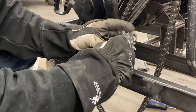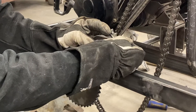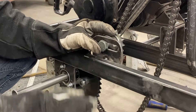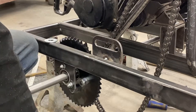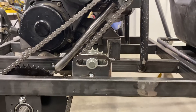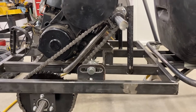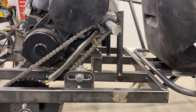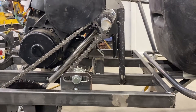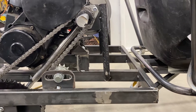I cut a little groove in there and I want to put an adjuster bolt so I can keep the tension on there. I'll probably need some threaded rod or a long bolt — I might have to make that as well, but it's pretty simple. I made up a chain tensioner today. I'm nowhere near ready for it yet but I wanted to get it set up because I'm still figuring out the exhaust. I'm now pretty confident I can bring the exhaust out and over, basically how it would sit normally on the snowmachine with some minor modifications. That's a good thing.